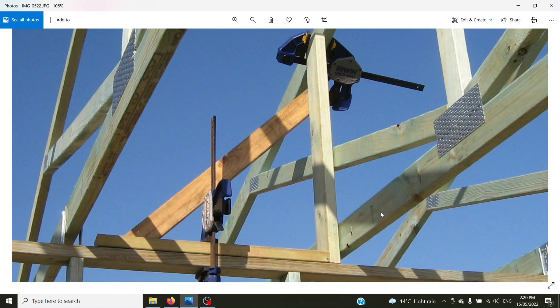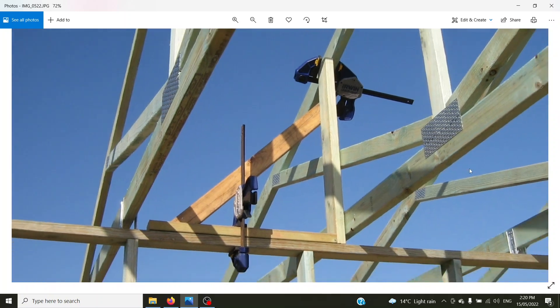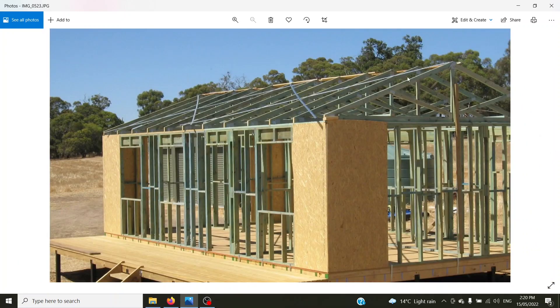If you don't have a center wall frame and you're using a rectangular spacer to get your trusses vertical, you're going to have to put a cleat across the bottom of every cord to stop it skipping back when you put some load on it. The diagonal brace straps here are fastened down — the purpose of that is to stop this side bellying in and to stop the roof moving around or walking. That has to go on before the purlins go on. At this stage where I've got the corner braces in place I cut the corner brace down level with the top plates.